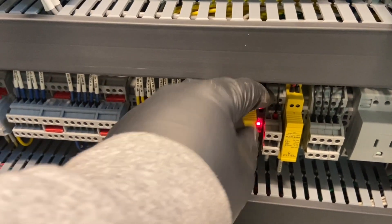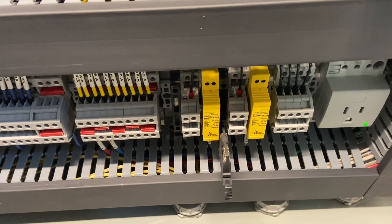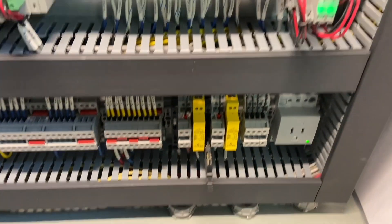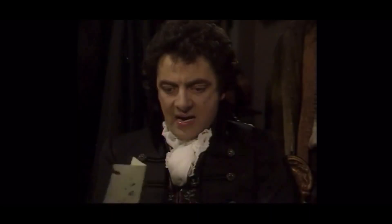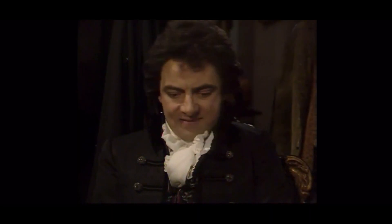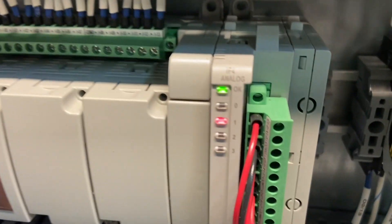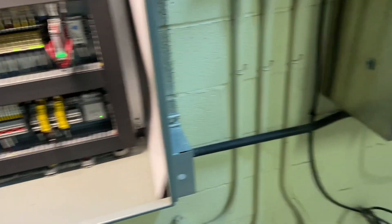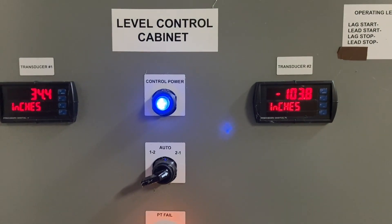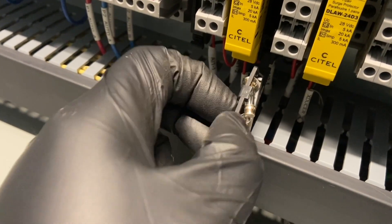Let's take a look at this little electron pill. It's the one for the secondary level, so that kind of makes sense. As soon as I pull it, the signal splitter gets mad, and so do the analog cards on the PLCs. Now they didn't freak out until I completely disconnected the fuse holder, because the little light in the fuse holder has just enough resistance to keep the milliamp loop within range. But as you can see, once it's pulled, we go completely out of range and into the negatives.